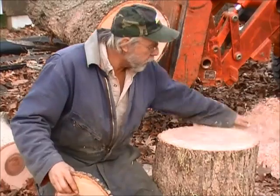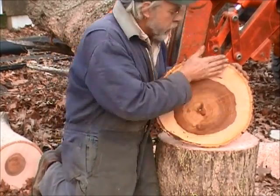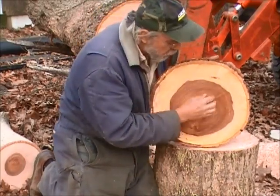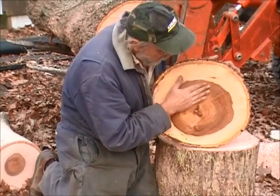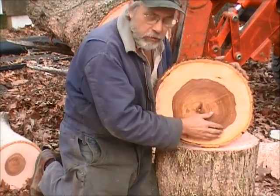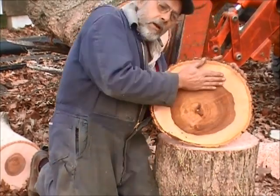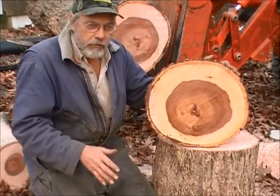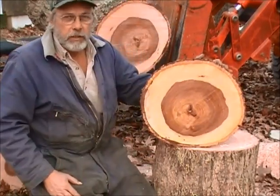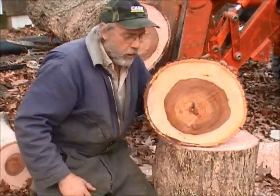When you're cutting a bigger log — a log bigger than your bar can reach — come over here like this and cut this away, cut down here, then come back up and slice down right here and remove this wood. Because if you come in this way with your bar, you're leaving all this wood right here — it's got something to grab hold of and you can throw that bar right back up in your face. Remove that wood this way, then bring your saw up and around and finish your cut. You'll get straighter cuts and it'll be a lot safer. It's no guarantee, but it's better than trying to go through it and then coming back to cut again — that's a dangerous way to cut a log when your bar isn't long enough.